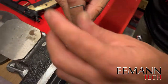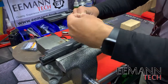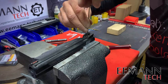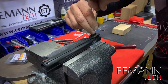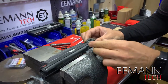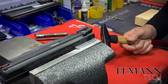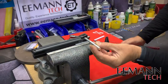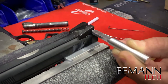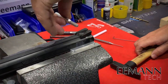We're going to use a 1.5 millimeter allen key to loosen those grub screws. I want to take them a fair way out so we don't have them dragging on the slide. When you're locating your punch on a rear sight to drift it out, you want to line it up with the groove — you don't want to be hitting it here and cocking the sight. You want to be hitting it right where the dovetail groove is.